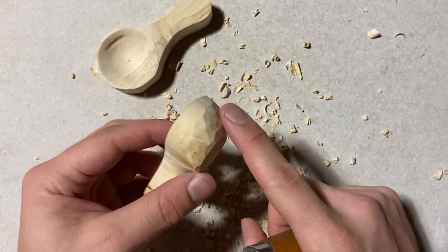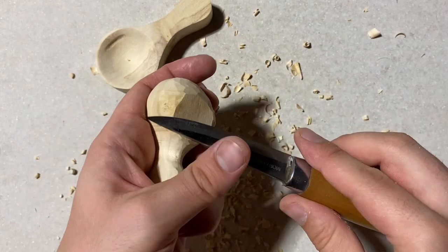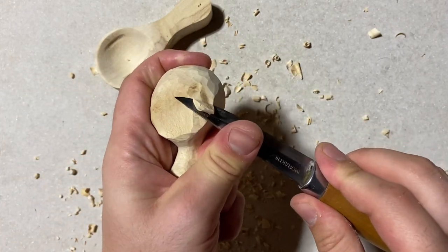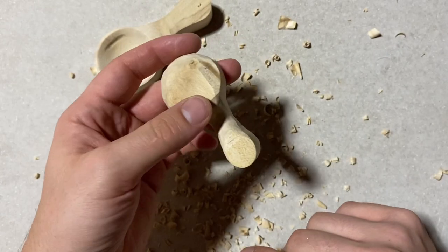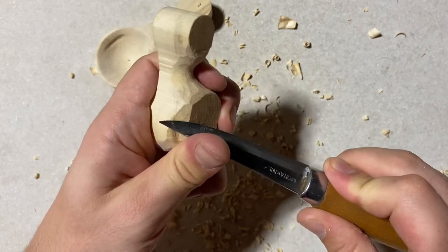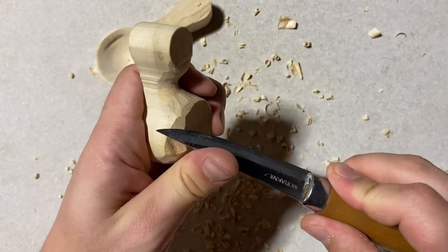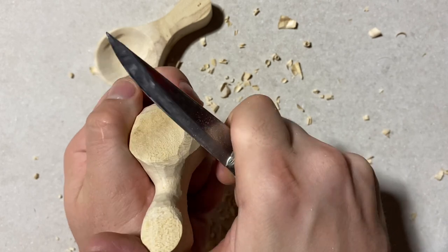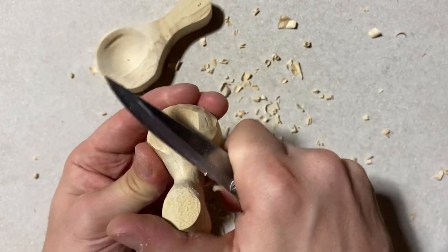Now that we've carved much of the bowl shape at the tip, we need to start carving the back of the bowl so it all blends towards the handle. We can't continue carving upwards because we'd be carving against the grain — if you carve that way you can see straight away the wood is tearing instead of carving cleanly. We need to reverse the grip. You have two options: reverse the grip and carve away from yourself, being very mindful of the knife tip against your hand and fingers, or if you're a more confident carver you can reverse the grip the other way — but be very careful about where that knife edge is relative to your thumb.